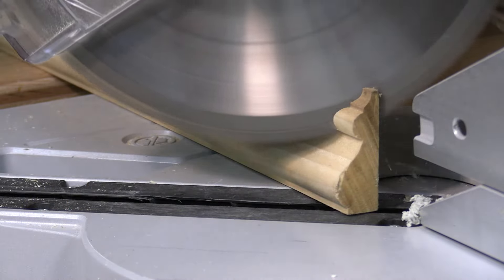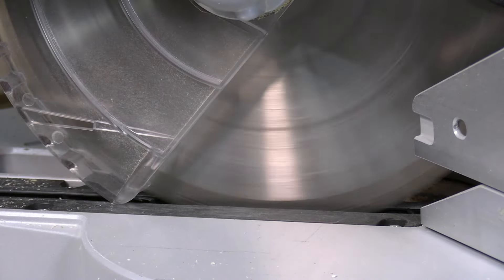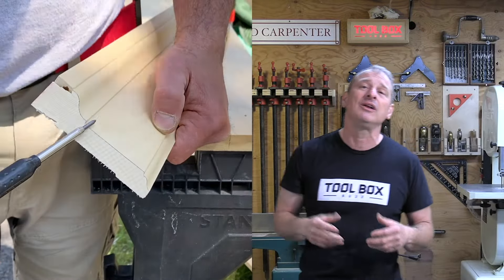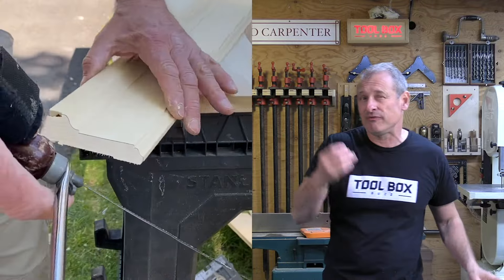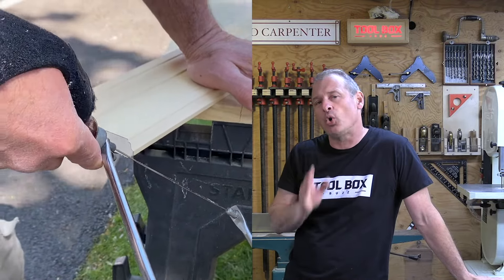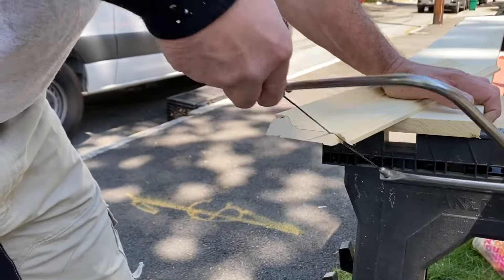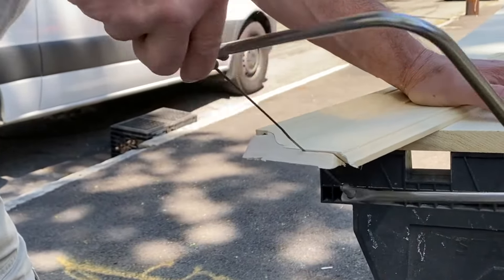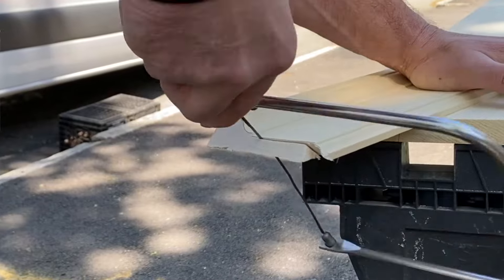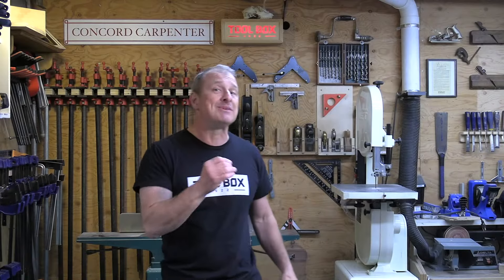Here's how to cope molding. First step: set your miter to an inside 45 degrees in the direction you're going to be running that inside corner. I usually take a pencil and trace the outer profile of the molding so it's more visible to your eyes. Then I use a fine-tooth coping saw and cut the bottom corner square. Continue cutting the molding profile edge with a slight 45-degree back angle — this is called back cutting. The back cut ensures there is no interfering material so the profile fits tight.